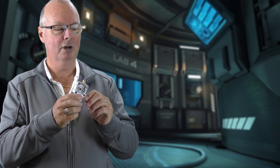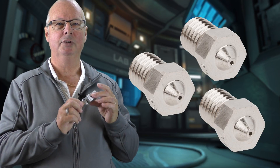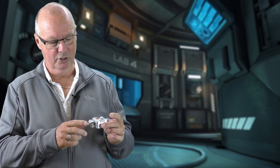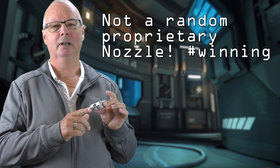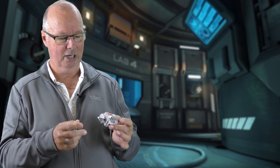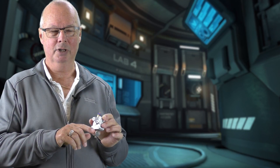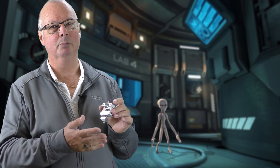There are a couple of other major things you need to know about this extruder. It comes with three stainless steel nozzles — 0.3, 0.4, and 0.5 — and these are also straight-up compatible with an E3D V6, so you can do direct nozzle swaps. It also comes with a full metal throat that you can use in place of the PTFE-lined throat in case you need to print at high temperatures — 250, 260 degrees plus — at which point the PTFE breaks down.